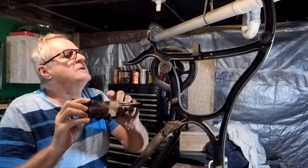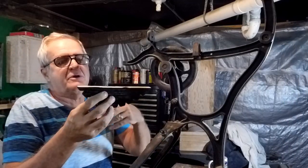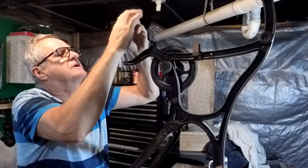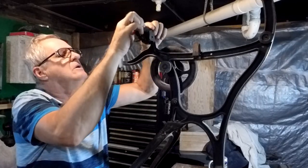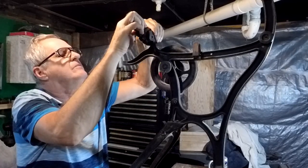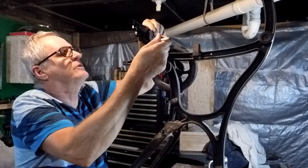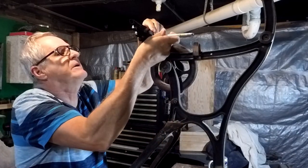I've got my piece painted one coat. I want to put another coat on it, but I want to drill the holes in it to mount it first. I've got the center marked. I'll just set that up there about where it goes. There's going to be two bolt holes — the first one I'll just make, then I'll level it up and make the second one.